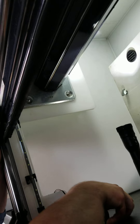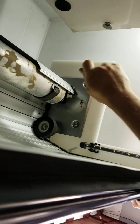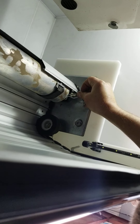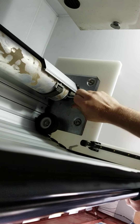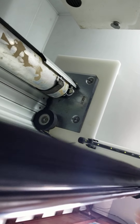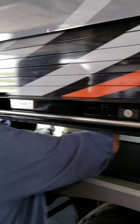He's gonna roll this back down just a little bit. He can find the roller hole and he's gonna pin it in right there. You can see he uses that pin and catches that little hole — the reason you do that is so the spring doesn't zing the door back up on you.